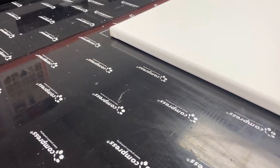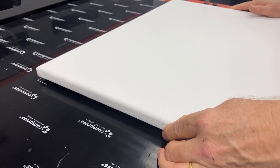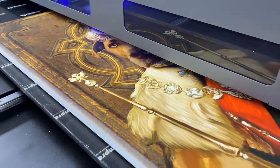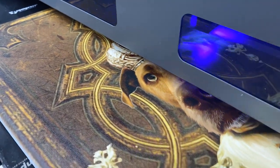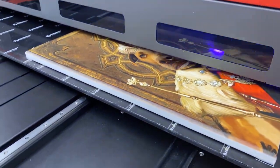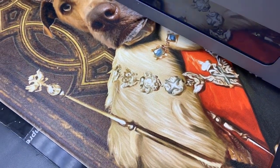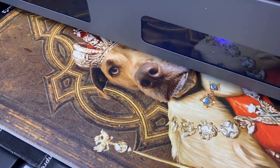I've set the canvas down here between the four corners. Generally on these type of prints, we oversize — in the software I'm sizing the image about a quarter to a third of an inch larger than the actual canvas so we get a bleed over. We won't have to worry about any white of the canvas showing. While we're printing, let's talk about the 1200. It's a unique machine in the industry because of its size. We could have turned this 90 degrees and put two canvases in there — 32 inches wide and 24 inches deep. The actual print area on the 1200 is right around 45 inches by just under 30 inches, with almost 12 inches of depth — 11.8 inch bed-to-head clearance. It's just a beast in the marketplace.